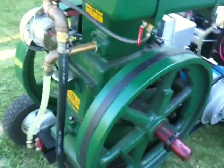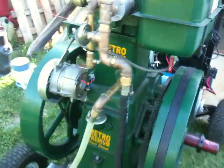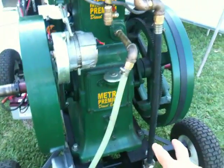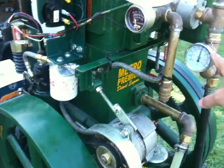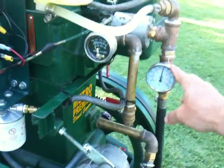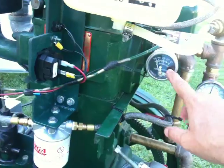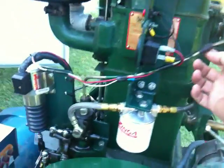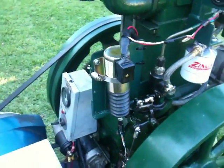The rest of this is a stock Metro 6-1 electric start system from India, and you can see he's got an alternator here, a little bit of plumbing that runs to the cooling system. Here he's got a coolant temperature gauge which measures the cylinder head exit temperature of the coolant, and here he's got a Murphy switch gauge which closes electrical contact if the engine overheats.